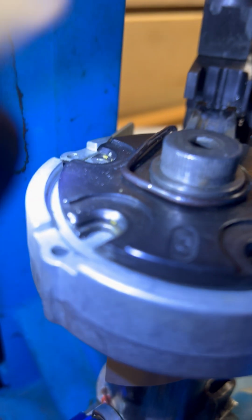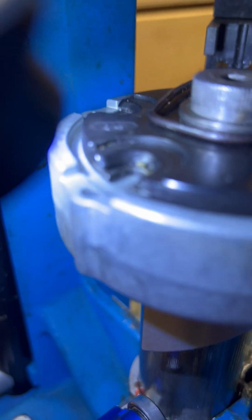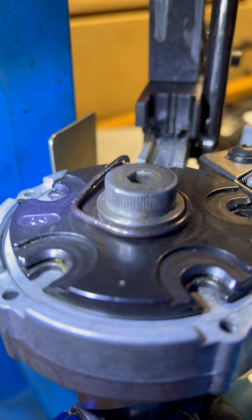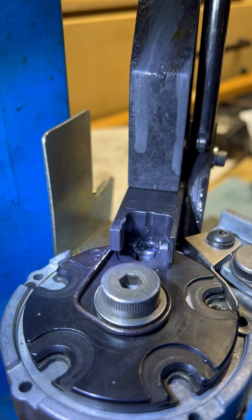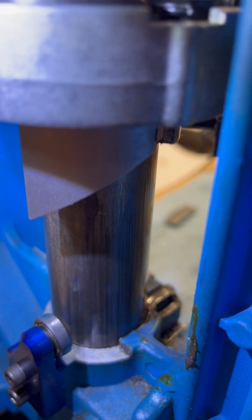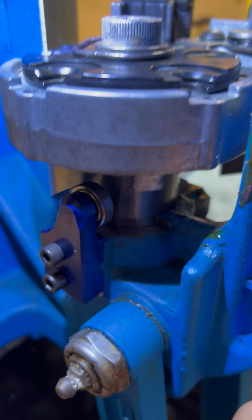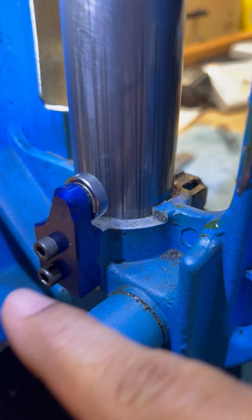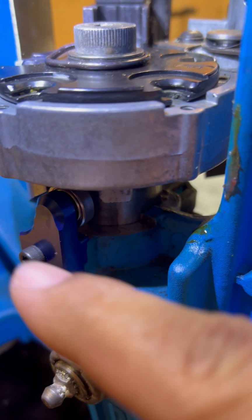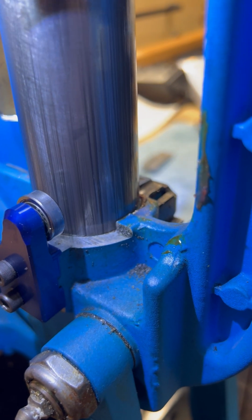And the other thing you have to do is when the brass comes out, get a better shot here, okay? This, right, I'm using the bearing pin underneath the shell plate. When the brass comes around and ejects at that last second there, if it jams, the problem is it won't allow the indexer to move properly, and then it'll snap the ring, the plastic ring I should say. This also allows you some adjustment right here, okay? So you can set the timing of this by moving this backward and forward so that it comes down and it winds up exactly where it needs to be.